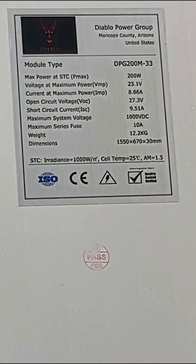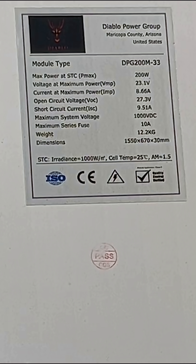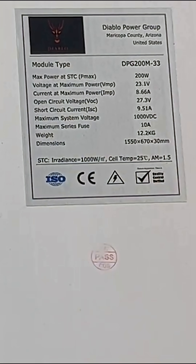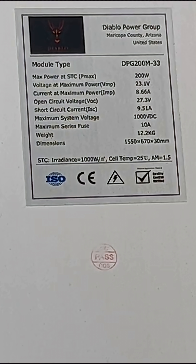These are numbers that we need to keep in mind when configuring our solar array, to make sure that when we're doing series or parallel connections, our voltage does not exceed the rated voltage of the charge controller we're using, and the amperage does not exceed the amperage allowable by the wire size you chose to run from the roof down to where your charge controller is located.